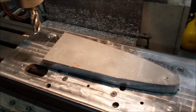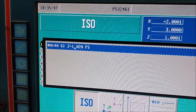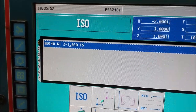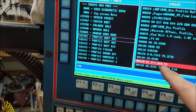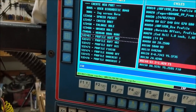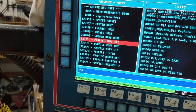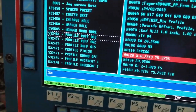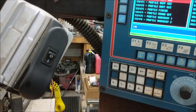That's done. I turned the three-phase power on, turned the mill on, got everything lined up, and I'm ready to run this part. I adjusted the feed depth for Z back to minus 1.02 — that's an inch and 20 thousandths below the top of the part. I replaced it and took one more look to confirm. It did change the code back down to Z minus 1.02, so we are ready to push the button and make some chips.